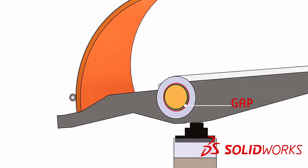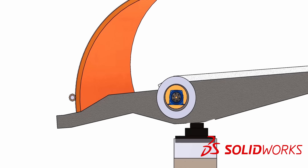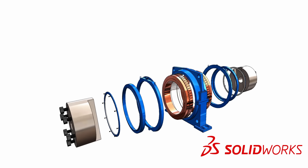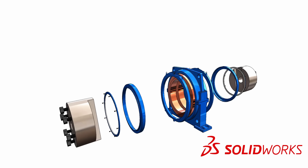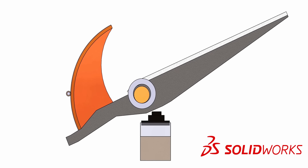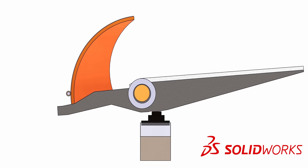Notice the formation of a clear gap between the bearing shaft and the bearing itself. This also means that the load on the bearing is completely relieved. This is the reason why the original trunnion bearings are still working fine. Trunnion bearings are renowned for their ability to handle immense static and dynamic loads, making them ideal for applications like bascule bridges. It's almost impossible to believe how engineers of 100 years ago thought about overdriving the pinion gear and relieving the load on the trunnion bearing.